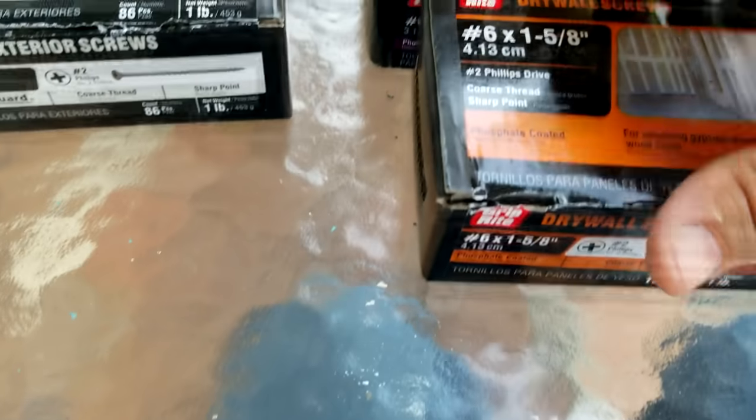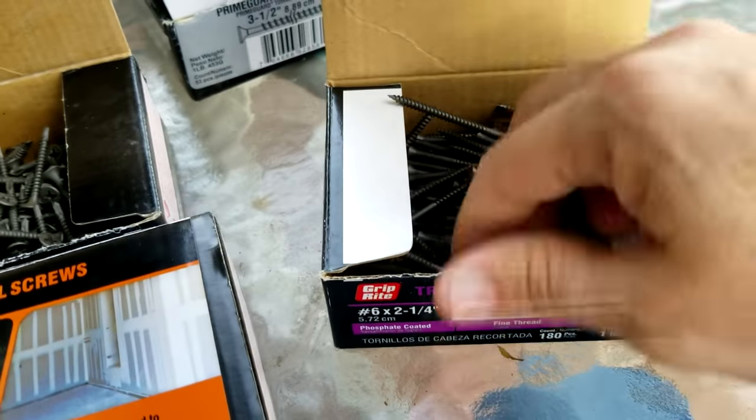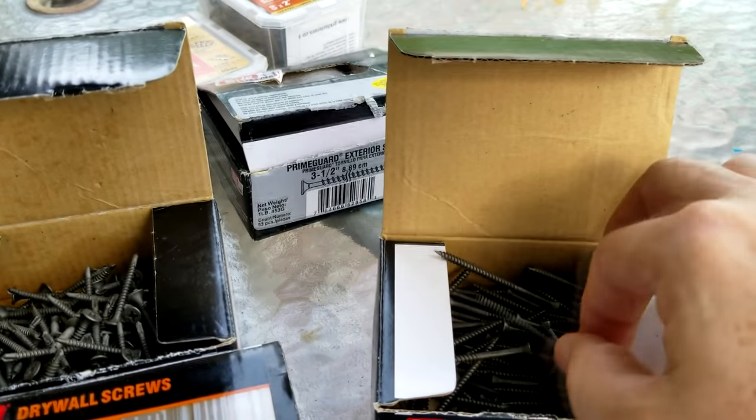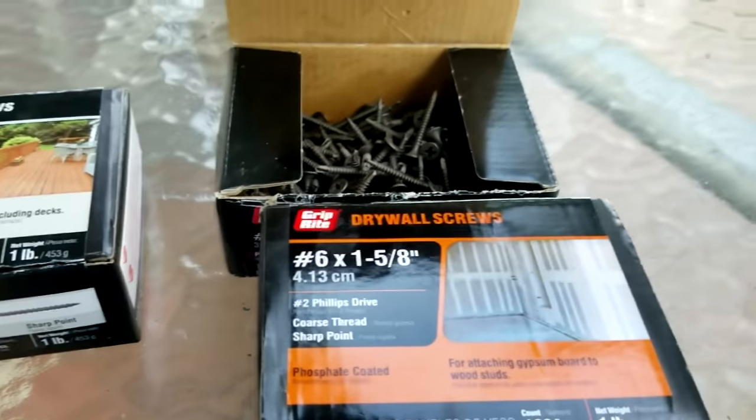People have to keep in mind that just because you're looking at the edge of a cabinet doesn't mean it's perfectly straight. Wood has a curve to it whether or not your eye can see it. When you put two side-by-side pieces together, that's when you find out it's not always exactly straight, which is why you'll be putting in screws every few inches in order to suck that crack in so you can barely see it — just a hairline.